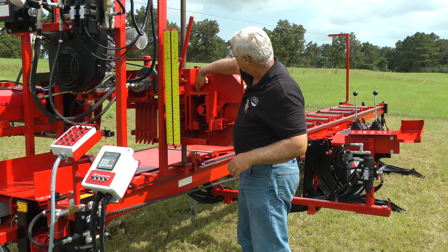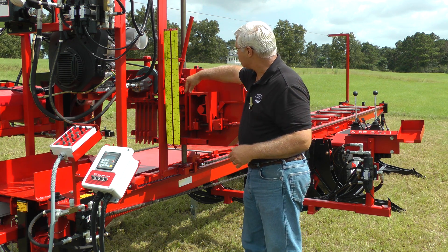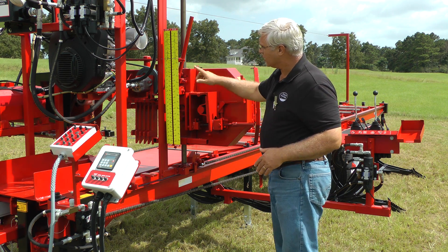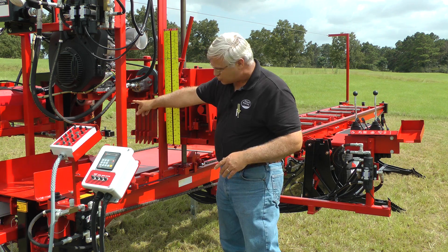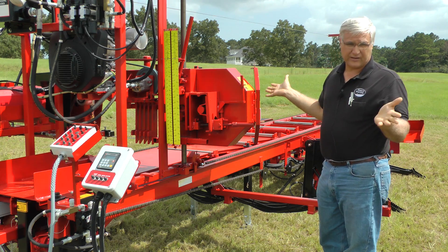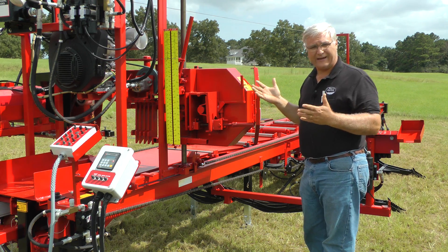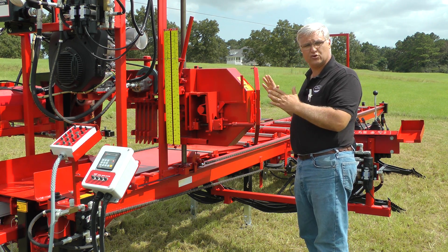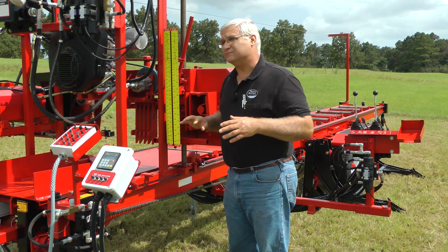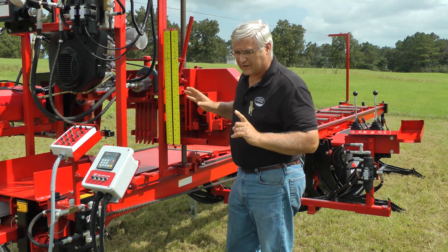These two plates on the other side — that's all there is over there — that is the tracking hinge. We would do the same thing over there. This wheel right here is adjustable here, and the other wheel has a tracking hinge on that side. When we originally set it up when you come and pick up your mill from us, we have each wheel set already. But they do have to be tracked individually. Once that is done and you lock these nuts in place, technically you should never have to track them again — but they have to be tracked in the beginning.